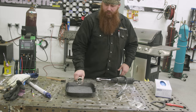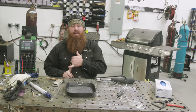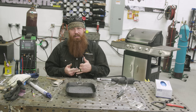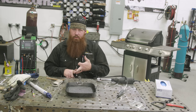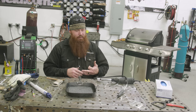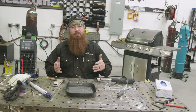She's still a little warm but should be good to go. So that's pretty much the process: first, clean it — it can't be too clean. Then go ahead and put some pre-tacks on there and grind everything out to get a nice groove so you can follow it when you're welding and get good penetration. Do a little bit of preheat — probably overkill for a cast iron pot, but if you have any critical castings, definitely recommend the preheat. Then weld it out and follow that up with the post heat.